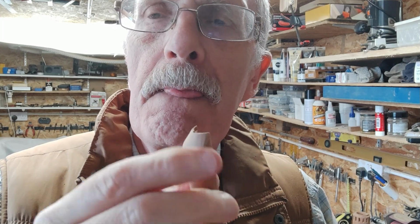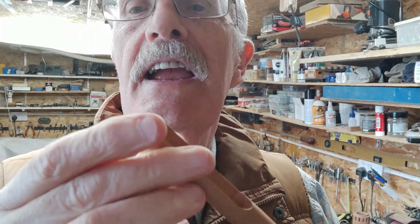And this is when it gets difficult, because when you first buy your tool and you haven't got the skills to grind it by hand, how do you get a consistent sweep and get it at the angle that you've been told is the best angle to get? So you get a jig, or you grind by hand. And I'll show you, I used to grind my tools by hand, and it was an acquired skill over a few months. But you know, after practice you got a consistent edge to a certain degree. There were times when you couldn't get the flipping thing to cut because there was something you didn't quite get right, such as your muscle memory wasn't quite as accurate as it was the day before. So you spend your time grinding metal away, and this is why jigs came in, which saved a lot of trial and error, and repeatability was created.